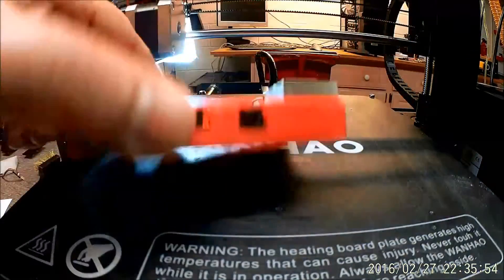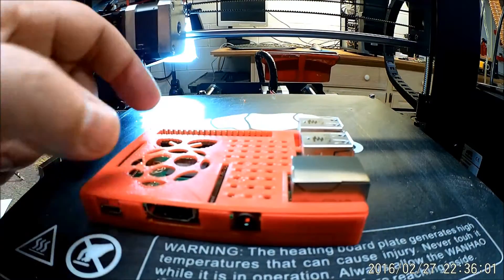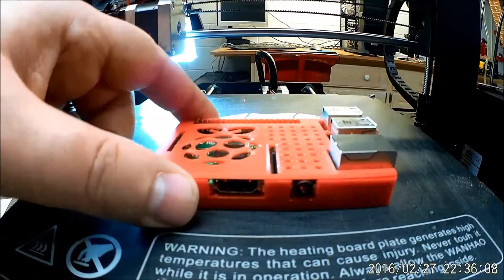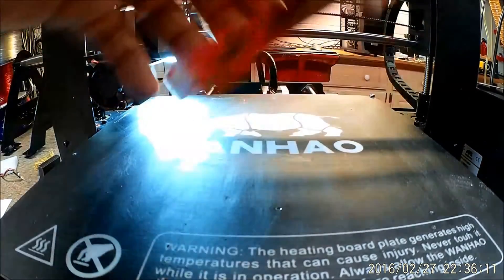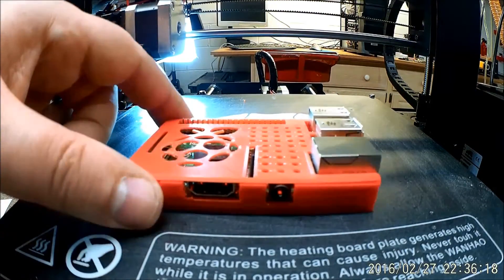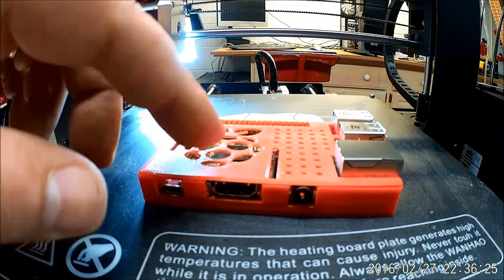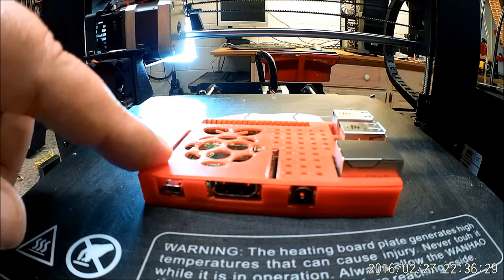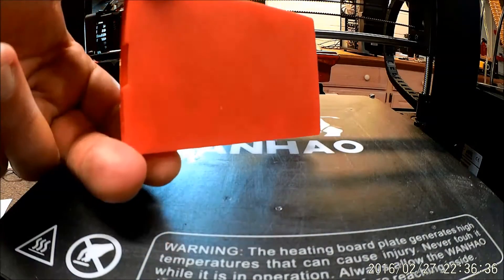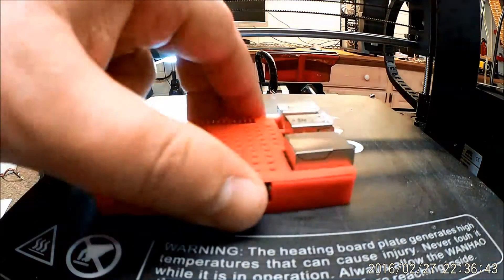Make it a little bit less distortion. Hey, this really didn't come out too bad. In the background on the DaVinci, I'm trying to print the sleeve one that failed in my last video, and knock on wood so far, it's coming out actually pretty good. This was a really neat project. I had wanted to do this in PETG, but I'm having troubles with the Wanhao keeping it hot enough for it to come out reasonably nice in such a configuration. Part of the problem is this raspberry logo — it really didn't want to do a nice job on the raspberry either, and these holes weren't coming out very good. But the bottom side was coming out pretty good. If it's a bigger flat area, it seems to work fine, but these other smaller areas don't seem to do as well.